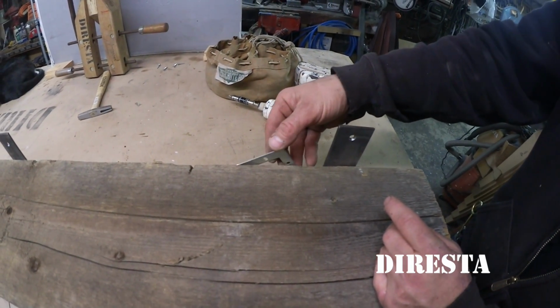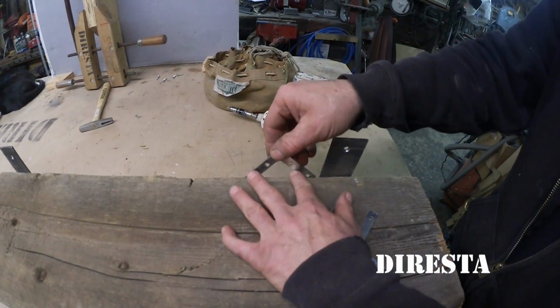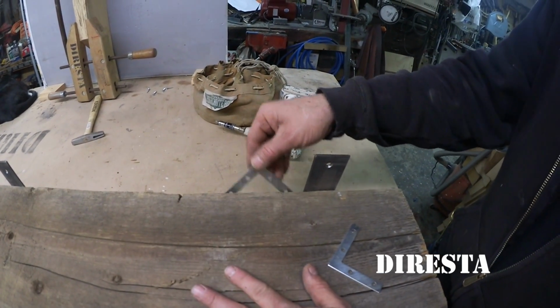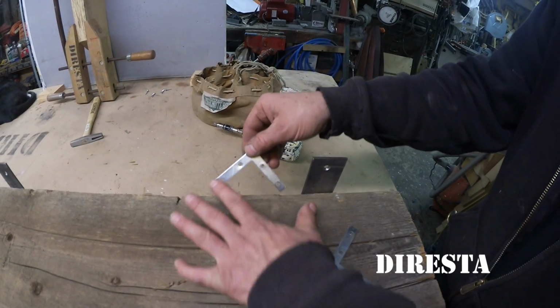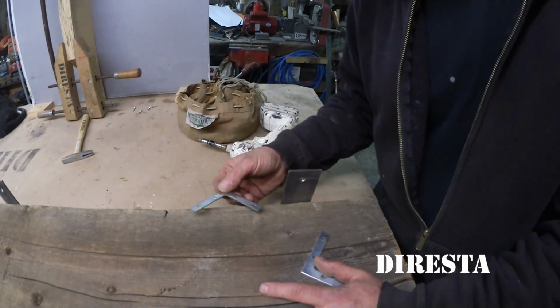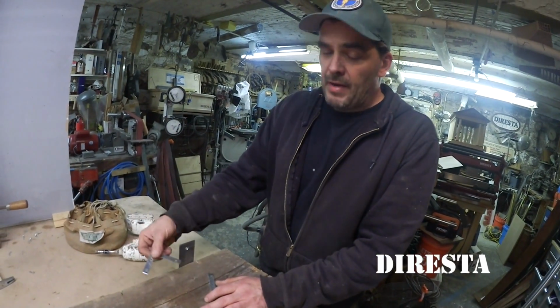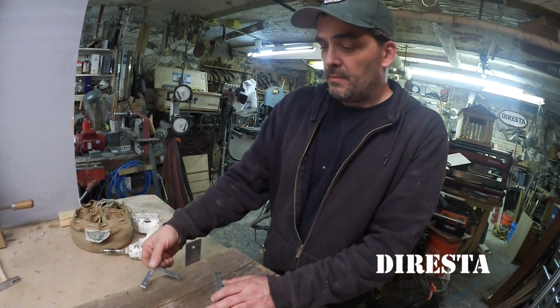And then you do that, put 2 screws into the back of the shelf and then 2 screws into the wall. But of course, this is out of scale. They make these bigger, so make sure your scale is appropriate, your screws are appropriate to the weight, whatever it is you're going to be putting on it. Make sure your fasteners are appropriate to that size and scale.